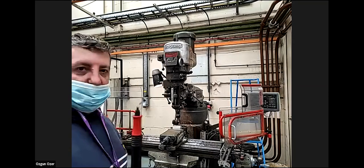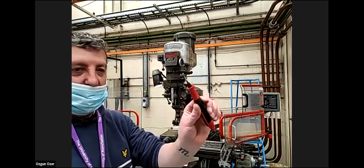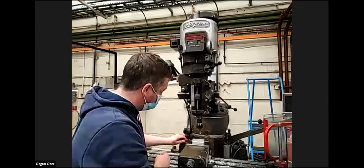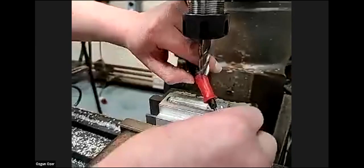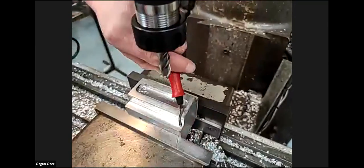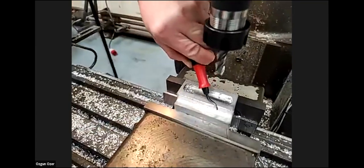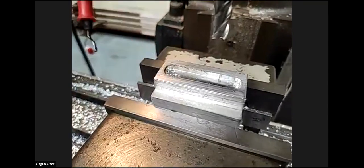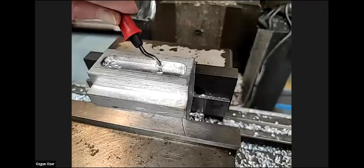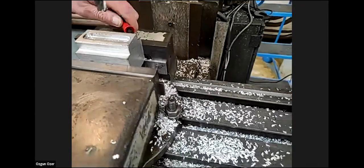I'm just going to take the burr off. We'll start under here. I can show you the local handy burr tool. All we do is we get the tool and you go across, and you should be able to see a little bit of swarf coming off. And that's taking the edge off. So this is doing a little bit of chamfering there, right? Yeah. It's easy when you've taken the component out of the vise, but I'll show you quickly in the vise.